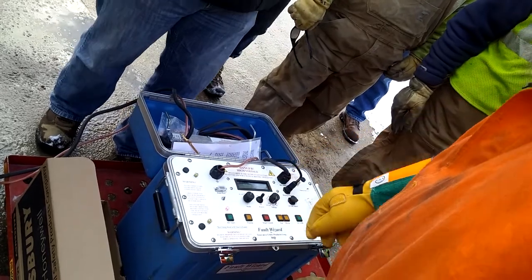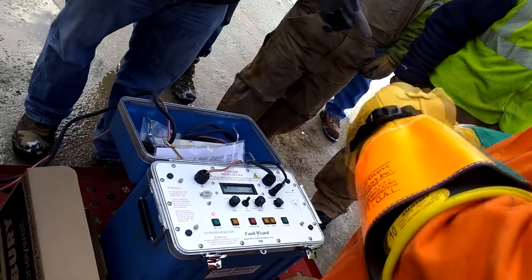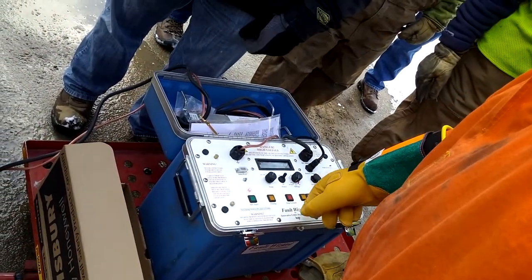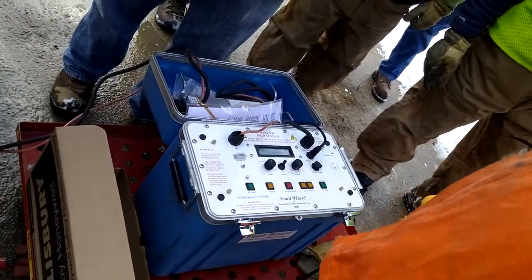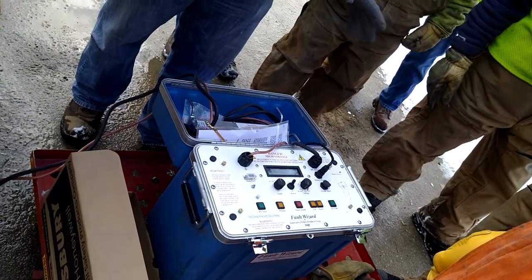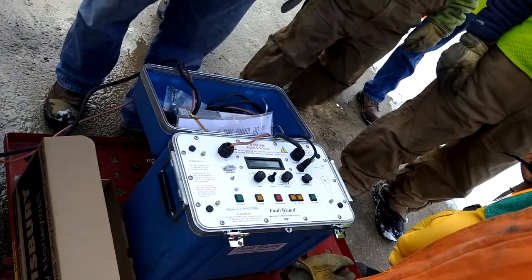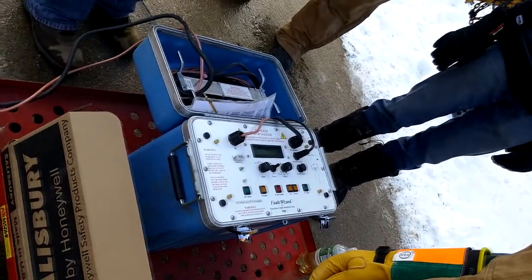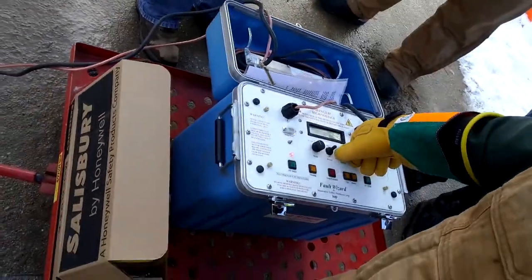So we know it's a bad cable. When we go to our other tests — like cycle thump or high voltage TDR — we're going to need more than seven kilovolts to have it show up, so we'll want to use at least nine. When you switch modes, it kind of stop-grounds for you automatically, but always get in the habit of pushing that button anyway. If it's a good cable, it will hold voltage and just stay there — then you want to make sure you hit stop ground to see it discharge. Now we're at zero kilovolts, so we know there's no charge on the cable. We're going to try to find a footage to the fault now — he went to high voltage TDR mode. Go ahead and hit HV start.